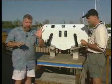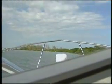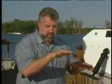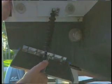And Fair, let's start off with takeoff, because my problem on the Mako, prior to me having any type of trim tab on it, is whenever I tried to get up on plane, I rode nose high pretty severely. I could hardly see over the tow rail. It was kind of dangerous, and I needed something to add some stern lift to get the bow down. I had gas-assisted tabs on the boat, and they kind of acted like springs. When you're traveling in the water and water pressure is hitting them, it would raise those springs up, and then when you would stop, it would keep them locked in the down position, and you saw the problem with that backing up.